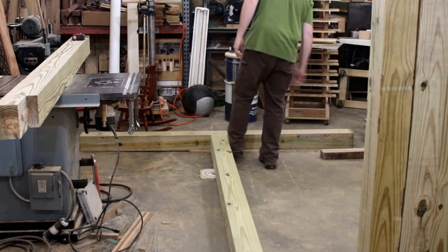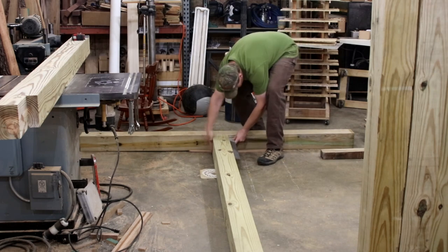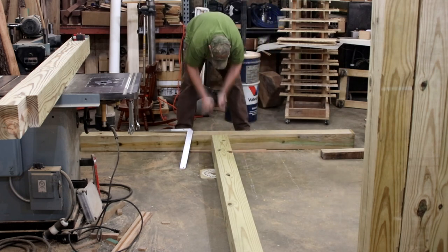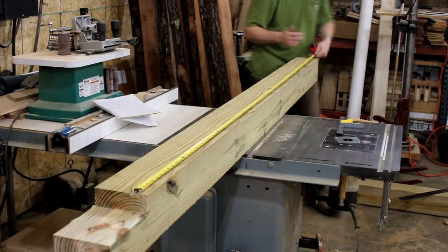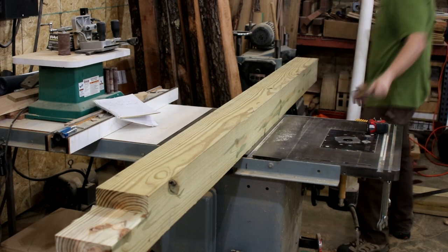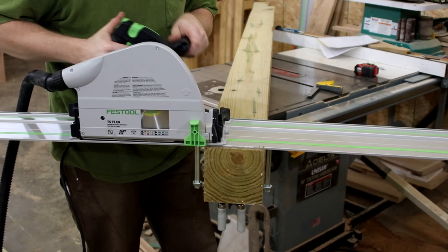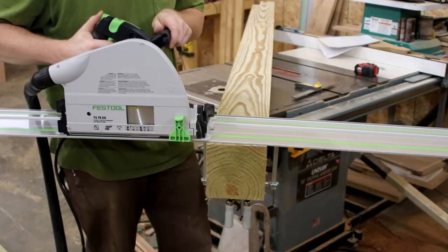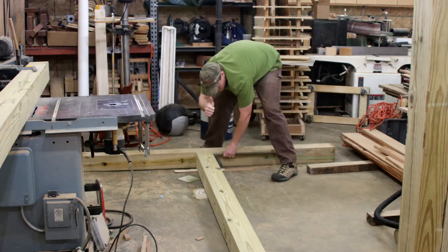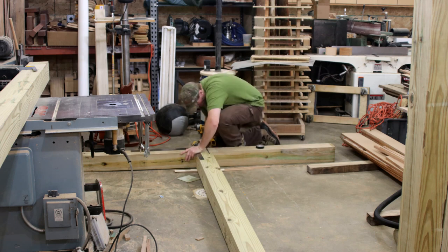Now you're going to see me start to square up the gantry. You can see this is the beginning of assembling the base. I was just using normal timber screws to assemble this whole thing together. I've used timber screws for other projects in the past and I've been very satisfied with them. At this point I realized that the timber was not square on the bottom, so it would have been impossible to get the gantry nice and perfectly square. I had to take the track saw out again and cut the base perfectly flat with that.